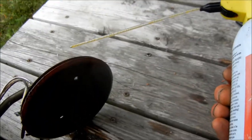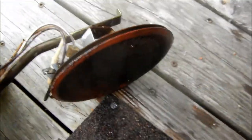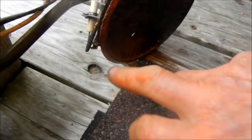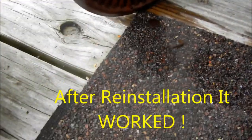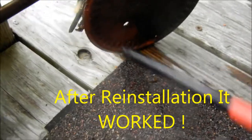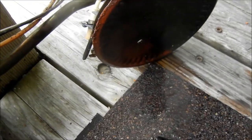Here's what I did: I got my PB Blaster with the nozzle and sprayed some down there, then heated the whole thing up real good. I sprayed some down this end of the orifice and sprayed it again down here, heated it up, and it started coming out this end. I think we're clear now. I'm going to put this line back on and blow through here — we should get a small amount of airflow through that now, so we should have enough to run the pilot.